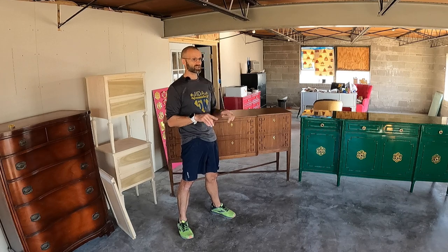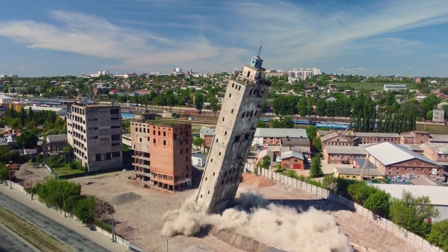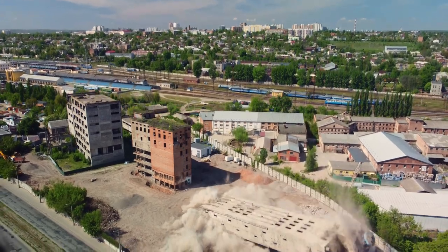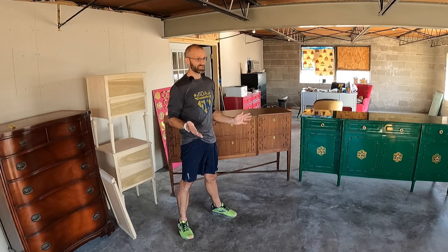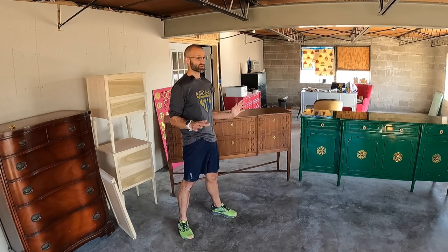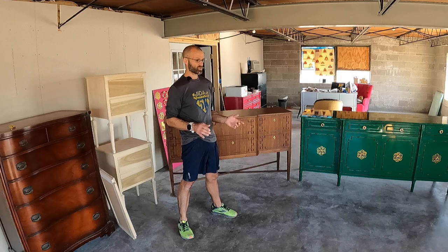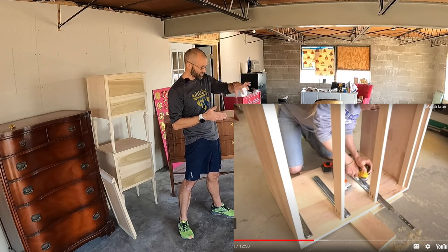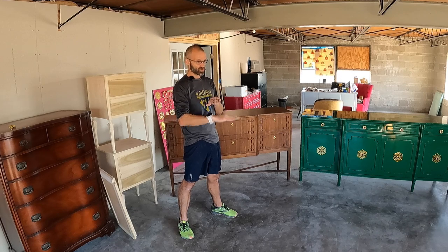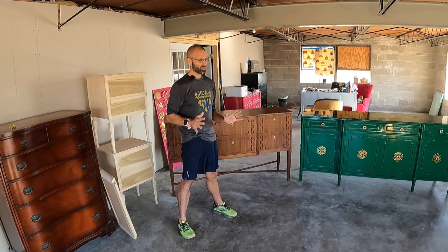You take a carcass — you got your top, your sides, your base — if you go to the side of that cabinet and lean on it, that cabinet will essentially fall over. It's just not that stout. Without a face frame and without a back, the cabinet is not very strong. In modern furniture we see this everywhere. Anything you get from IKEA is made this way. Any low-end furniture, any furniture that costs under around $2,000 is going to utilize this construction where you just have a little tiny piece of two or three inch material across the face to separate the drawers.